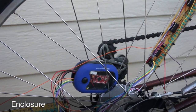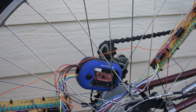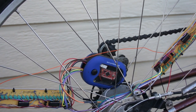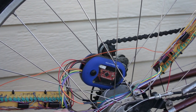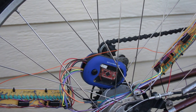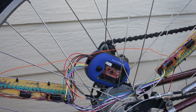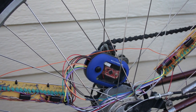The first thing I did was put it inside of this flashlight case, and to get it in there, I hacked the ever-loving daylights out of it. I broke all the LEDs off of the main board, took the switch that was in there — the handy power switch that toggles between two sets of LEDs — took that off of its board, flipped the board over, bent the leads up so that the switch was then surface mounted. That allowed me to get the Badger in there without contacting the main power leads against the top of the FTDI chip.